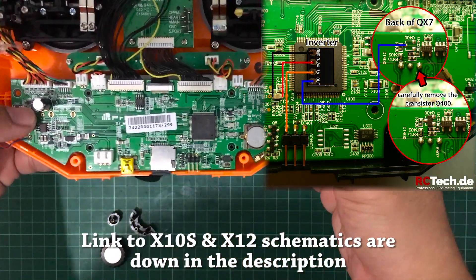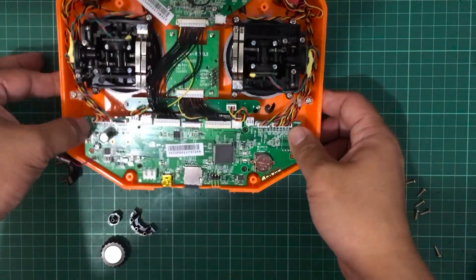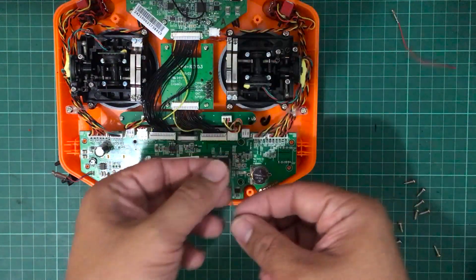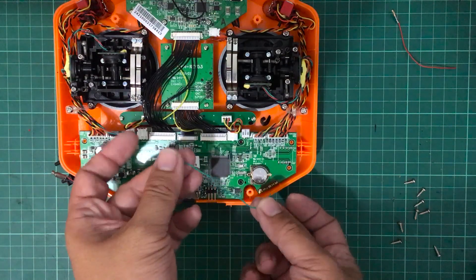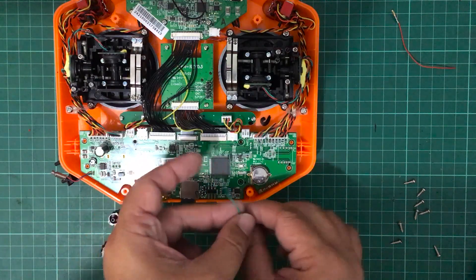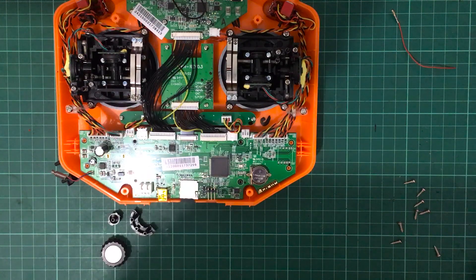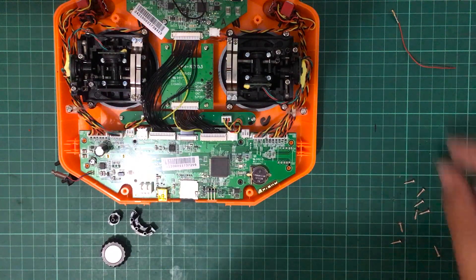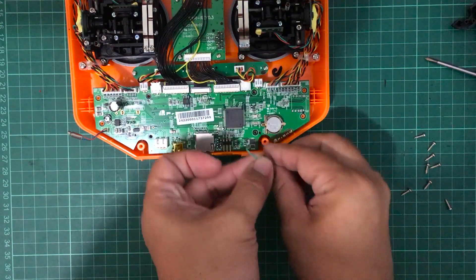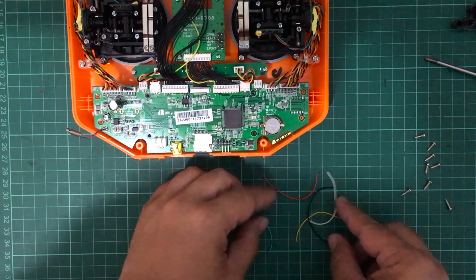It's very small — you can compare it to my fingernail. We only need to solder onto one of those pads and we need a wire that will go from there all the way back up here to our mod chip, which we'll tape over here probably. One thing you want to make sure is the length of wire you're using — don't scrimp on the wire. I'll probably use something like this length of wire, which is overkill, but more is better, especially since you don't want to open this up again if your wire is too short.